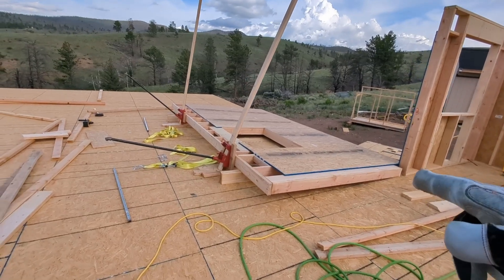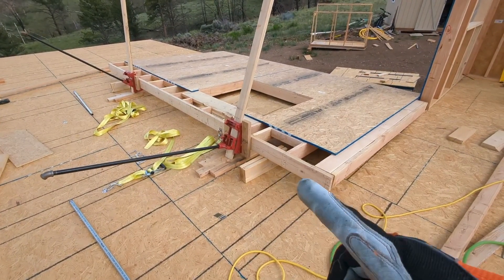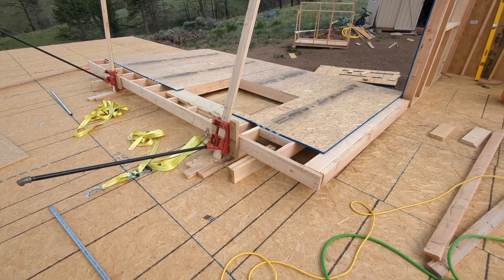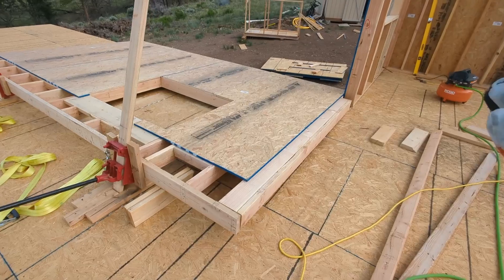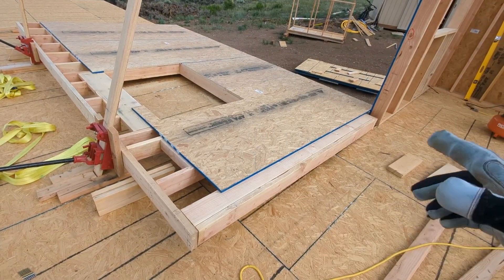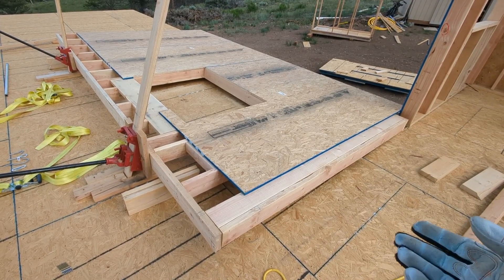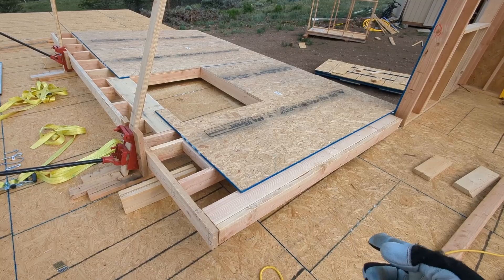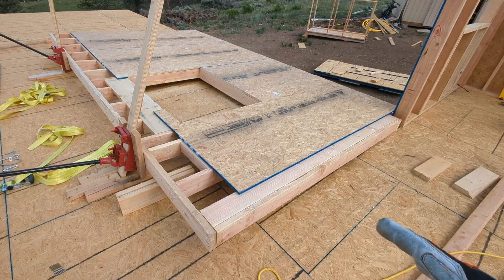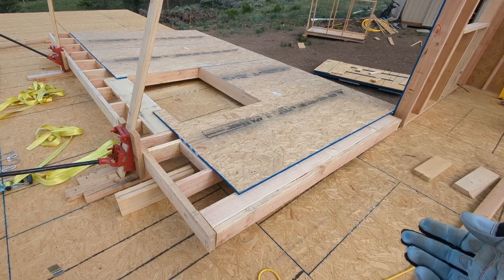A couple of risks. As you're lifting these walls, if you get a little carried away and you're lifting solo — which a lot of people get these jacks to do, as I've done — bear in mind you're talking about a very heavy wall. I have three and a half sheets of OSB on this wall, not fully sheathed. Depending on your thickness of OSB, you're talking anywhere from 60 to 90 pounds, plus the weight of your lumber. I've got a two-by-six framed wall, some headers, some miscellaneous bits. A common wall — you could be lifting 300 to 600 pounds.